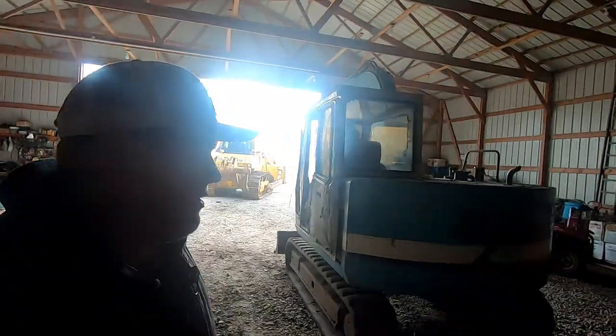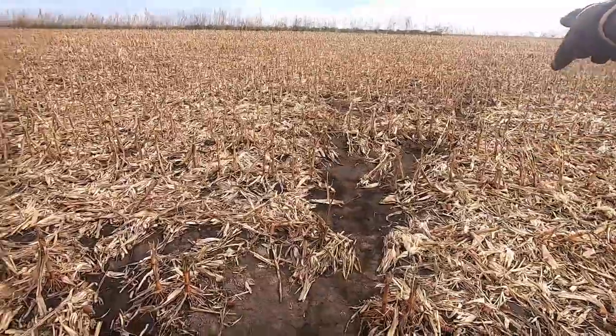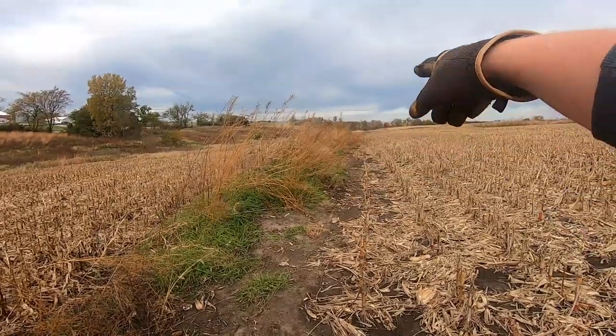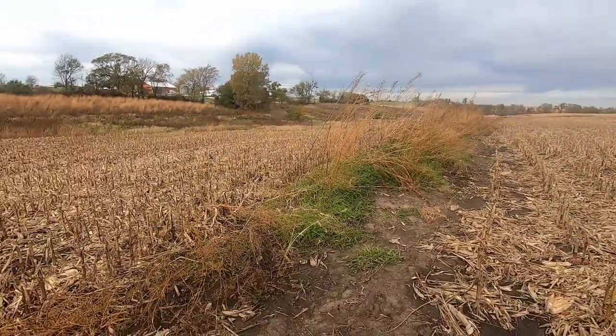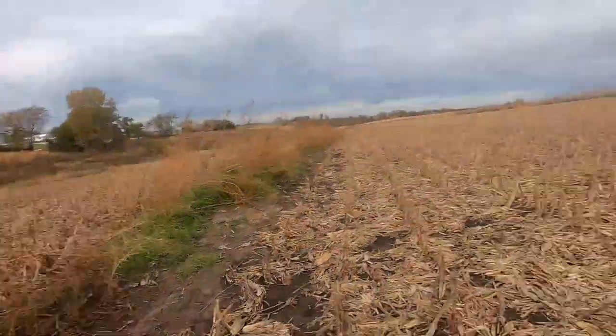Lunch time and story time is over. Look right here - we had water coming down this hill that didn't get caught by this terrace. These were put up by us, they weren't actually designed, so I've got to cut some dirt out of this spot and put it here so that we've got slope going down to that inlet. That way we're not running down the hill like that.